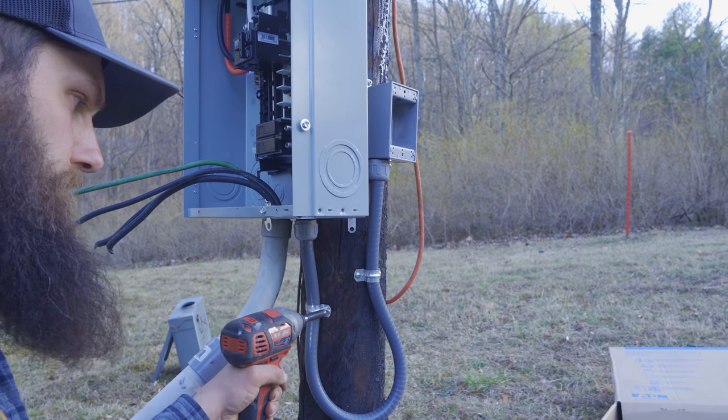For a short load run, push these wires through and bend them over — it helps the jagged ends from getting stuck, so with a nice round end the wire goes through a lot nicer. Now we're going to install our GFI. You can't use any standard GFI like you have in your kitchen or bathroom outside — it has to be a WR-rated one. WR means weather resistant. You have to have these outside. The inspector will come through and check that. If it's not WR rated, he'll make you tear it out.